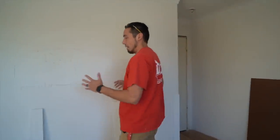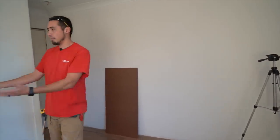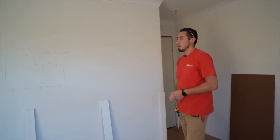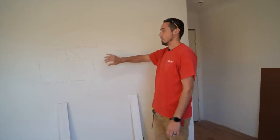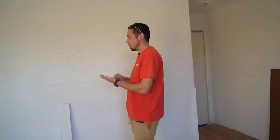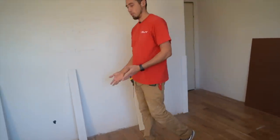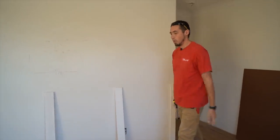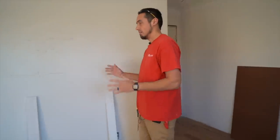So we've got four panels here, three panels there, and the one-panel section. The last two walls follow the exact same process I just showed you — I'll spare you the repetition. A couple of practical notes: if I was working in someone's house, I would never draw on the wall like this. I'd do the math on scrap paper or my phone. And I would have the floors protected before I ever brought the first tool in — roll out paper and protect the floor.